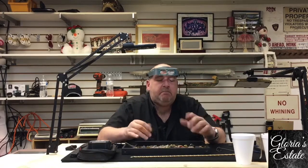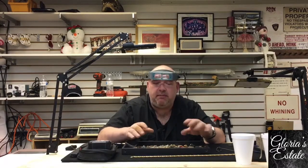Take a ring, throw it on the scale, and you know that gold of that weight will take up a certain amount of space. Well, how do you measure that space? Throw it in a jug of water. If the water level rises to that exact amount of space that ring is supposed to take up compared to that weight of gold, you have real gold. I will tell you that it is a more mathematical way to do it. I do not see many people in this country use that. However, it's very popular in Europe.